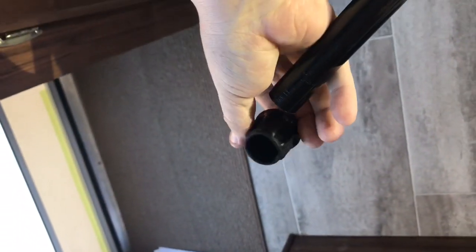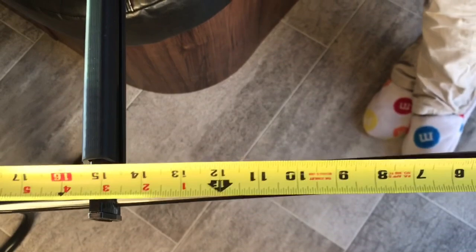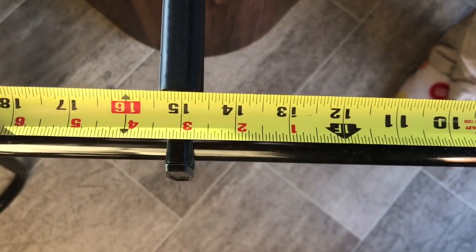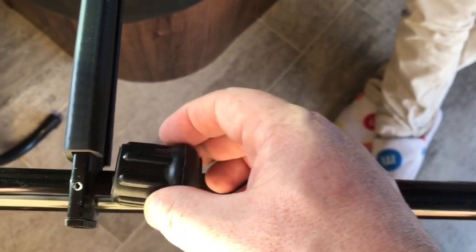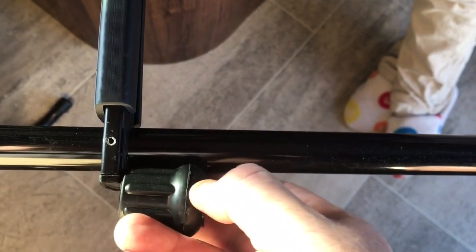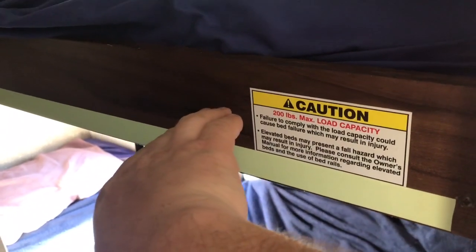The rubber stop on the bottom just twists and slides right off — it's just a rubber cap. Now doing some quick math: if I cut at 14 and a half inches, it would be too close to the first bottom rung, and there wouldn't be enough leg left to actually sink down into the boot. So I can't go to 14 and a half; the furthest I can go is 13 and a half. That leaves just enough leg to go into the bottom of the boot. Moving up an extra inch still leaves enough clearance into the two-by-four, so that's going to be perfect.